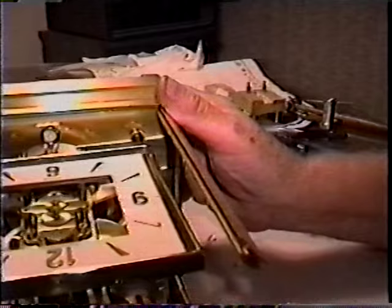Now, with that all complete, install the suspension spring. I have my roller all cleaned. I'll put it onto the pipe. It sits down in there. Set it down snug. And then take the spring and put a little bit of down pressure onto it. Very little, not much. And then lock the screw tight, so that there's a little bit of down pressure there and a little freedom here. Now, as you'll see, this roller is nice and free. It just rolls at will. And it should be. No oil, no nothing in there.